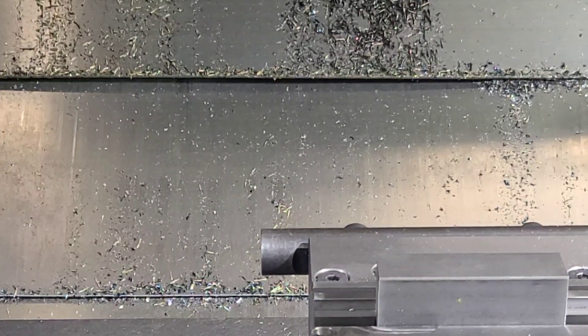I've got a half inch carbide end mill set up in the spindle and I'm going to just rip right down the middle of this, going back and forth ramping down at 50 thousandths per path. We're going to be running about 5,600 RPMs and 125 inches a minute. And like I said, this is not a precision slot — we're just demonstrating what effects it has on the exterior dimensions of the parts, and also it'll have an effect on our slot. So here we go.